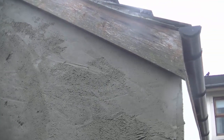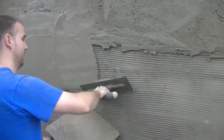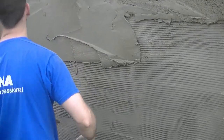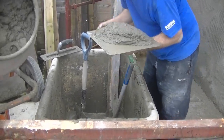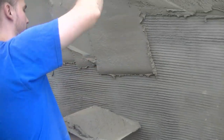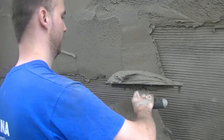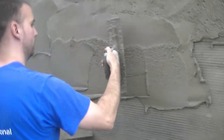Basically I have my top straightened here as you can see — it's all open. There are smooth bits around the edges where I just rubbed a wee bit more. You can see it's all straightened off where it looks rough and open. There are two different ways to straighten it: you can leave it open, or you can flatten it in which will seal the moisture in and give you a bit more time. I've got my wall well soaked down so I can leave it open and let the air in. You can see the way I'm coating with my hawk underneath, catching any bits that fall.